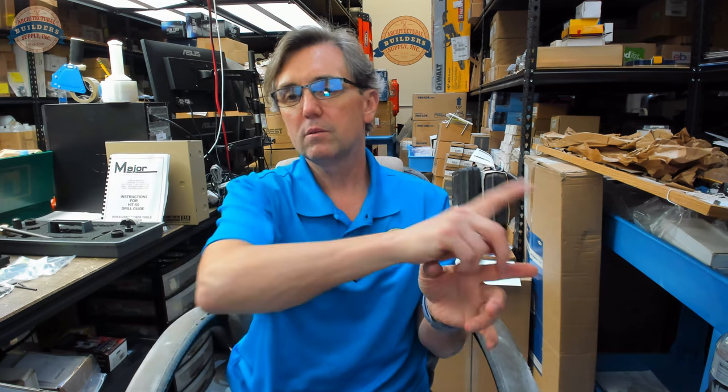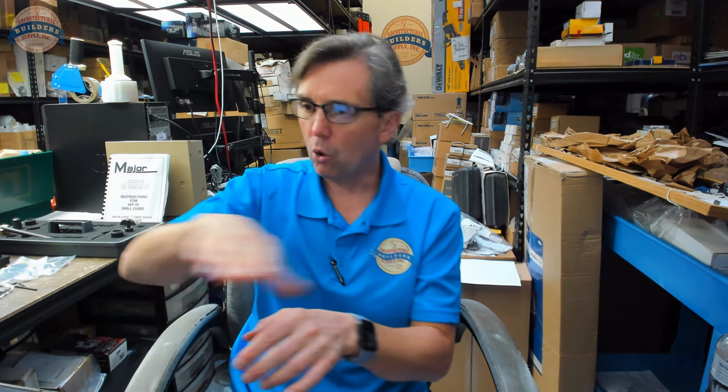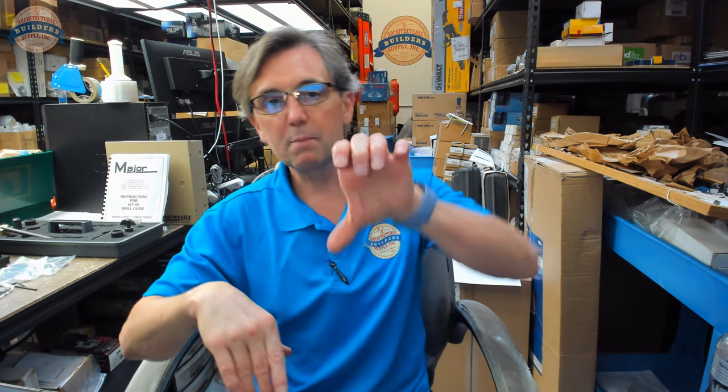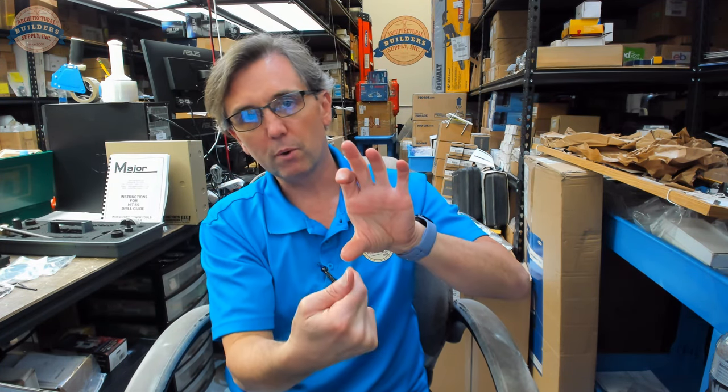Now I've got my height, a horizontal line where my, you know, whatever dimension, 38 1/8. I've got my edge prepped, marked. I take that back set finder and mark the face of my door on both sides. First thing I do, 2 1/8 inch bimetal hole saw. They're cheap. They allow you to drill into a wood door. They're flat bottom in the sense that you know when you're drilling straight when all the teeth around its circumference are hitting at the same time.